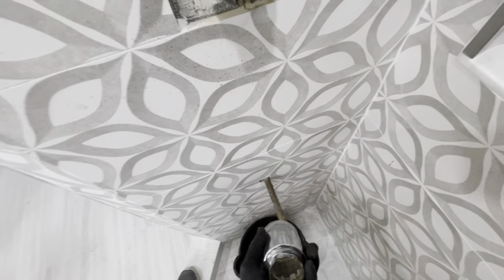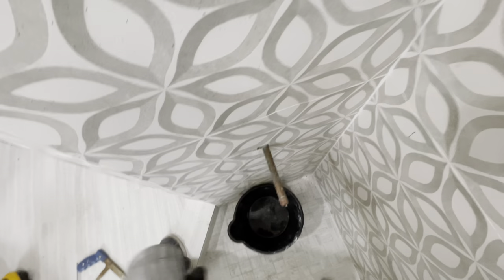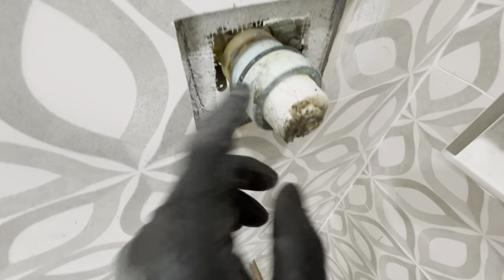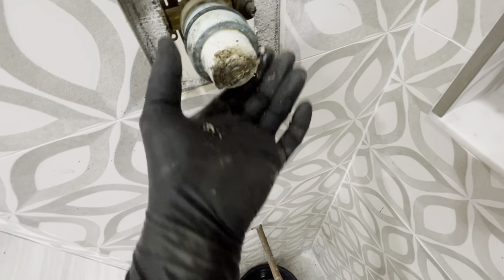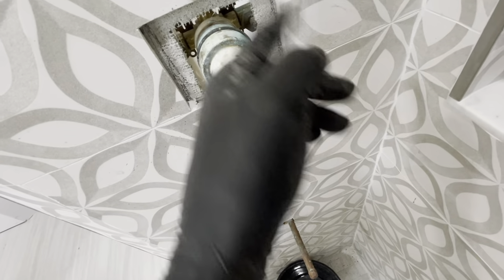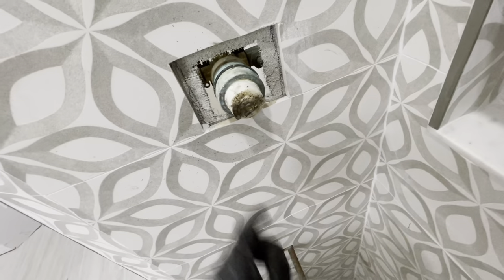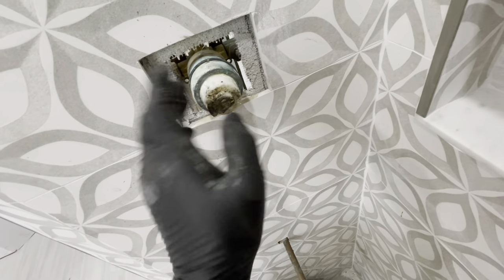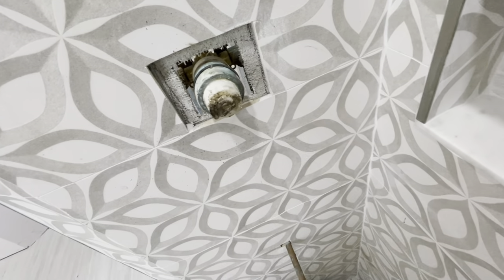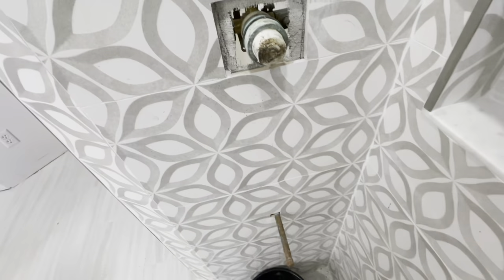Now you can go ahead and remove this piece right here. This is the actual ring I need to remove in order to get the cartridge out, but sometimes this ring is also a pain in the neck and the only way to remove it is to cut it. I'm going to spray some lubricant in there and leave it overnight — you can also heat it up. My main reason for the video was to show you guys how to get the handle out.